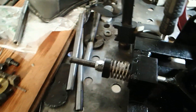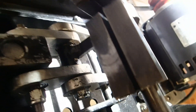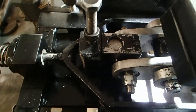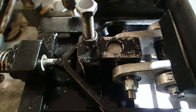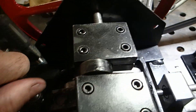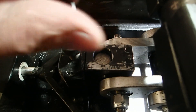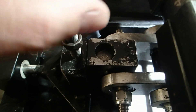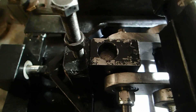I did the double toggle setup like Wilfley did. The benefit of that is that by raising this pivot block right here, you can change the stroke length while the unit is running. I still need to put a handle on this, but if you look as I turn this, you'll see that block raising up — and as it raises, that shortens the stroke length.